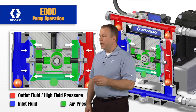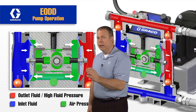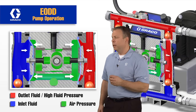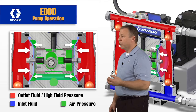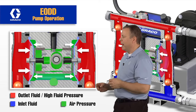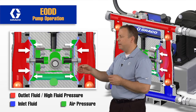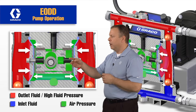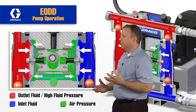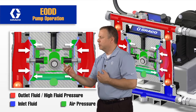These diaphragm pins are connected to the diaphragms, and they lead into this linear carriage, but those pins are not secured to that linear carriage — in other words, they're free-floating in there. So we're going to start this animation and then stall it out. What you saw there is the arrows got big indicating that the pressure grew. And now what you're seeing is as this carriage is moving back and forth, because the fluid is locked in on this side, the diaphragm stopped moving, and then the carriage starts sliding across this pin. We're going to run that through one more time and increase that pressure — it's going to stall out, and now this carriage right here is just sliding back across these two pins.